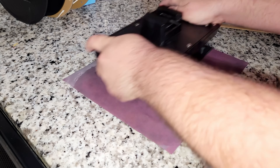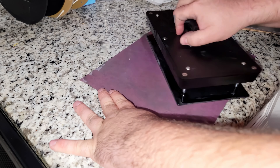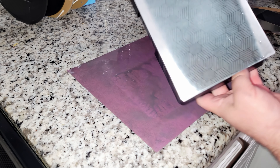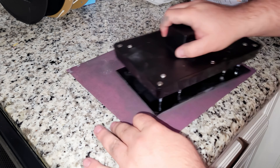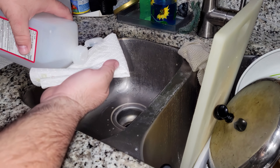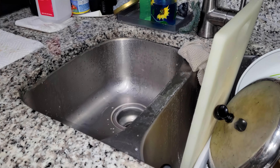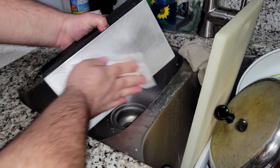After I went out and got my own sandpaper, I went through the incredibly painful process of sanding my build plate. Now I want to be clear, this has nothing to do with Wham Bam or their product — this actually has to do with Elegoo and my build plate having a two millimeter dip in the middle. I'm going to pause the video here just to show you how bad it was. This was after 45 minutes of sanding — that's all I was able to get off. As long as your build plate is not in taco shape like mine, you should be able to finish the sanding process in about 10 to 15 minutes. After four very long and excruciating hours, the sanding was done, and I took some paper towels and isopropyl alcohol and gave it a really thorough cleaning, because the build plate needs to be completely 100% clean before attaching the Wham Bam magnet.